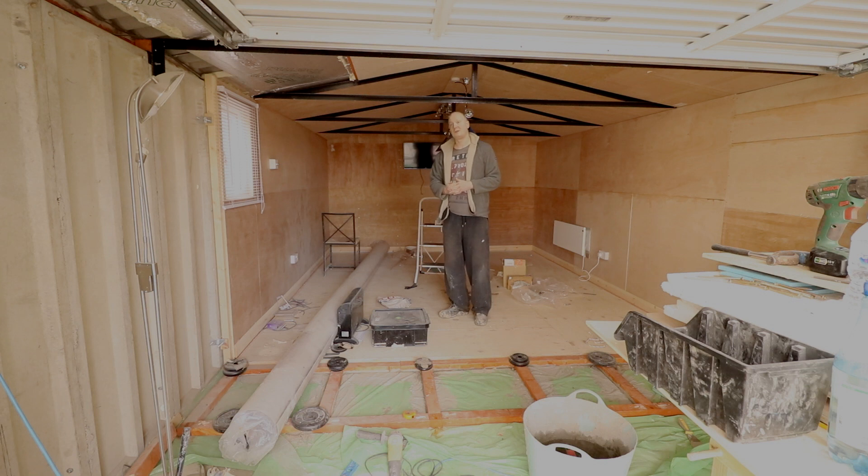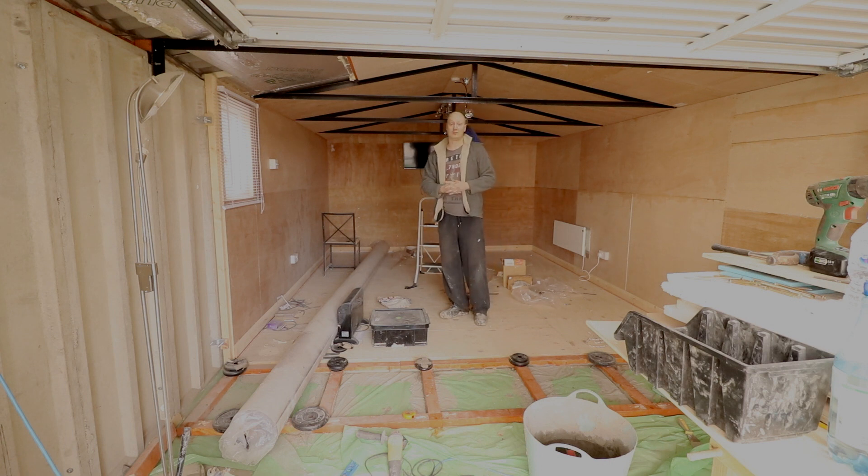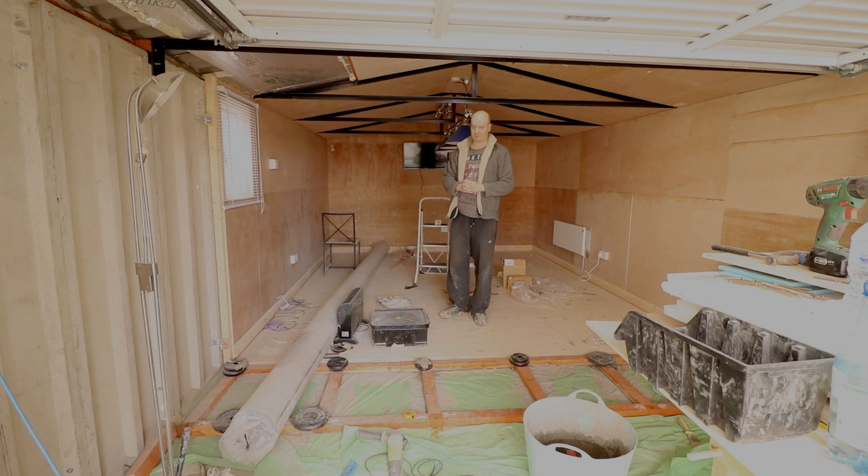The overall length of this Apex concrete panelled garage is 7 metres. I'm going up to about 5 metres in terms of the conversion, and at some point I've got to decide what I'm going to do about this wall. We're going to put some sort of door in the side, and at the front where the main door is, there are two schools of thought — either insulate the back of the door so we can still have a front door, or put some sort of stud wall over it and seal the door up with insulating foam.